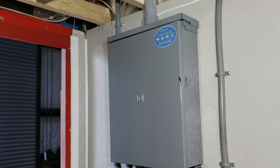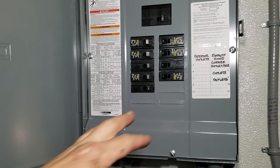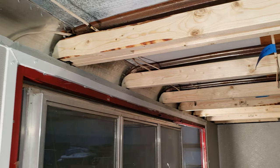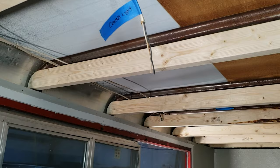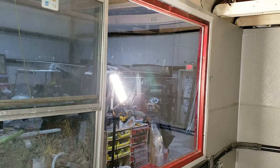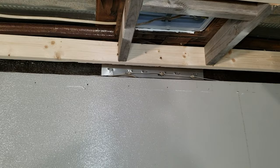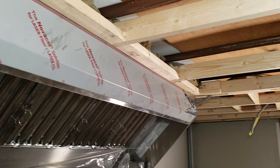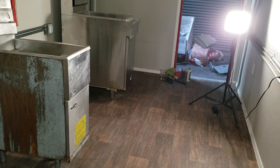Here's all the electrical that we put in — it's our new panel. Got most of the stuff labeled. Once he puts the lights in and stuff, he'll be able to know what went where. All the old white Romex you see was already here. We're not sure where he's going to put the lights, but he's got a light here and we also threw a box on the wall. We added plexiglass here to the back section of the window. We reframed the ceiling vent here, so when they do the ceiling they can add that. We put some blocking in for the customer to add the ceiling panel up, and sealed the vent to the roof.